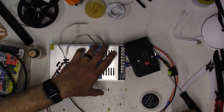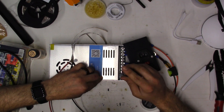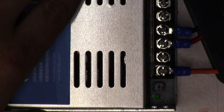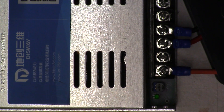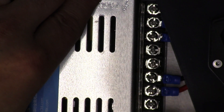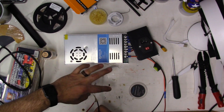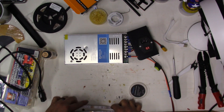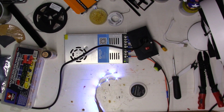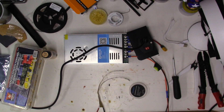Now we have our connection and it's time to wire it up. On the bottom of the power supply it'll tell you positive and negative. I'm going to go for this positive rail — unscrew it a little, get the wire under the metal plate, and screw it down nice and tight. For the negative, I'll go over to the negative terminal, gently slide it in, and screw that down. I'm going to move everything so nothing is touching, and we'll do a test — plug it up and make sure everything works before putting it back in the machine. As you can see, our lights are working with the power supply. Now we have working lights.